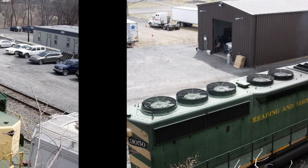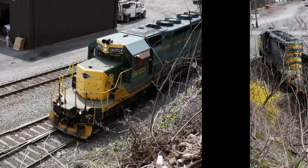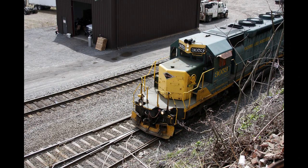The SD40 adopted the general hood dimensions and radiator design of the last two SD40X demonstrators, but also lengthened the front hood section housing the inertial air intakes and equipment blower duct by about 15 inches. The taper of the dynamic brake hatch was made steeper at the rear than the front to make room for the longer radiator intakes. Aside from these changes, the cab and hood were very similar between the late SD35 and early SD40.